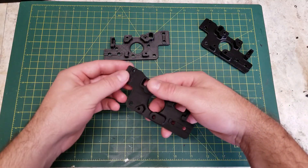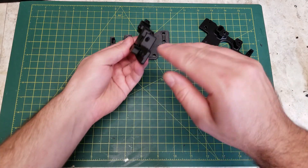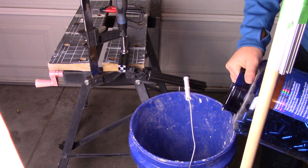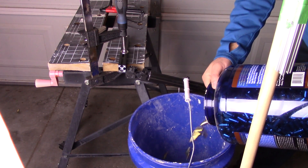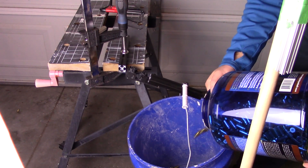The third part surprised me the most. This part was printed with the orientation of the toolhead going lengthwise — so along the long axis — and this held up to 4 kilograms of weight before breaking. At first this may seem like a big win, as it held up almost twice as much weight as the traditional method.